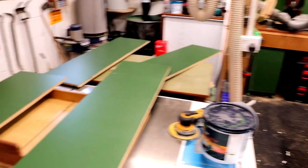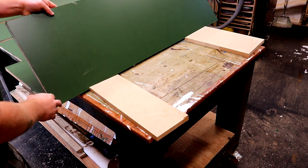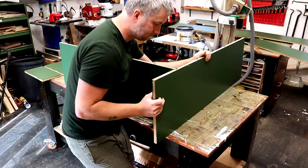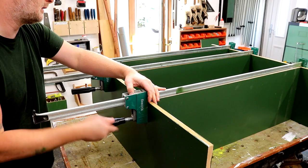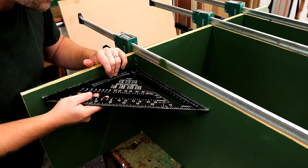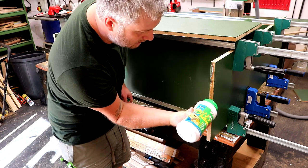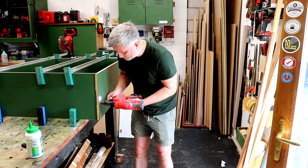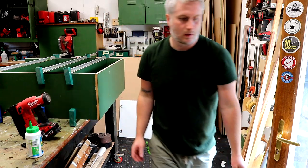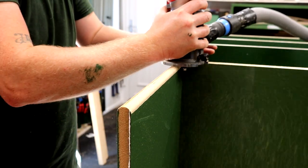The only problem I had was that I must not have let the first coat dry for long enough, as when I turned the panels over I had some MDF residue left by the scraps I was using underneath. So I'll need to do some sanding and touch up those areas with paint later on. I'm using polyurethane glue to assemble as it dries quickly so I can carry on working without waiting around too long. My parallel clamps help to hold it all together and I check with a speed square to make sure that the shelves are square to the sides. With all the shelves in I can then glue on the top panel — no joinery, just glued in place as nothing's going to be sitting on top of the unit. I'm using 18 gauge brad nails to pin it in place until the glue sets, and I'm rounding over all the front edges of the unit using my trim router just to make the edges more resistant to wear.